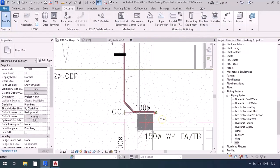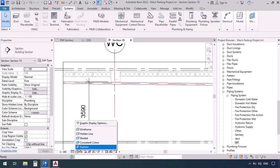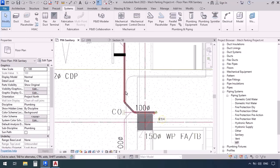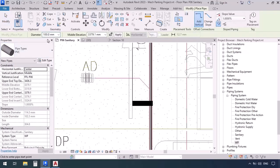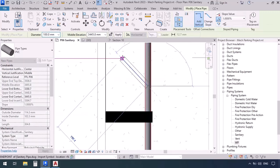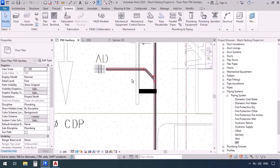Now close the extra sections, go into the last one, set detail level to fine and shade it. The elevation turned out to be proper, so we'll keep it. Now in the plan draw this junction — pipe command PI. Double-check PVC, WP, size. For the elevation, because it's in the middle of the pipe, use inherit elevation; and because we're getting close to the drain, select slope up. Click, click, then click and press escape. No extra fitting appeared.